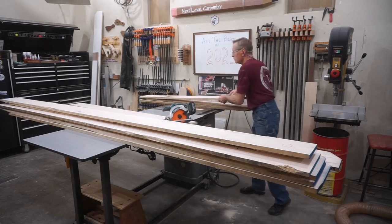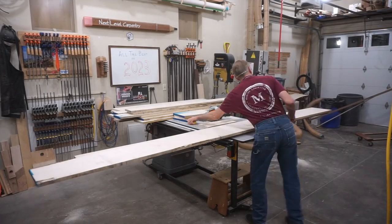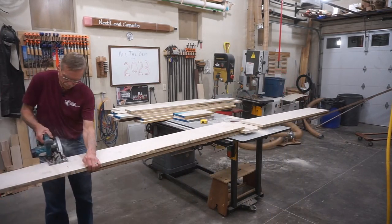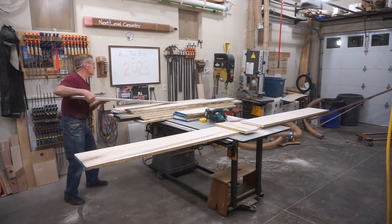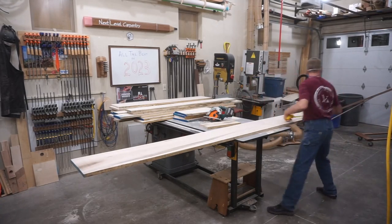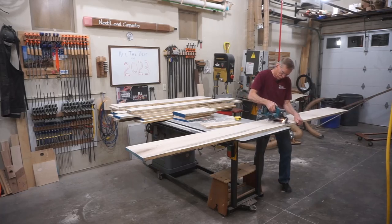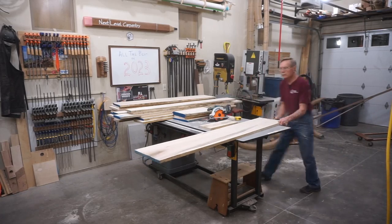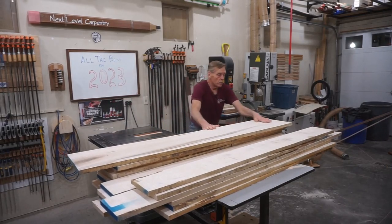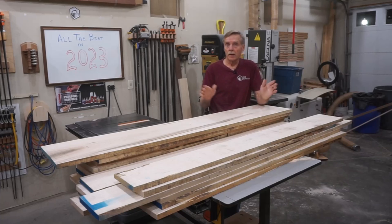Because the random width of some of the wider pieces is pretty tight for getting two finished pieces at five and a quarter inches wide, I pre-cut longer pieces down into shorter ones so that I can maintain the finished width I need after straightening the edges and ripping the pieces to rough width. I quickly assess each piece for final yield and then measure off a rough length at about five foot three inches, which leaves a sizeable offcut from the end of each of these 12 foot planks. Because these pieces are only cut to rough length at this stage, I just eyeball my cuts for square and lop the boards into pieces with a little cordless circular saw.